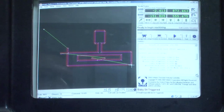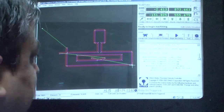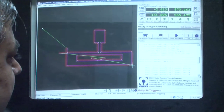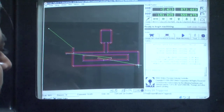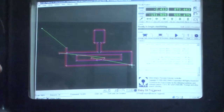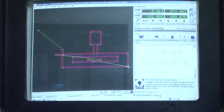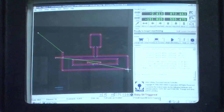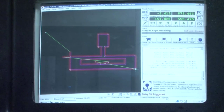Additional parameters include: jewel diameter after wear reading about 350 microns, abrasive flow rate of 0.3 kg per minute, and mesh size of 80 (abrasive mesh size can vary up to about 200). With all these values set, we are ready for the next step — enabling the pressure setup. There is an option indicating 'babysit triggered,' meaning we now need to fire the cylinders to generate the high system pressure so that cutting can begin.